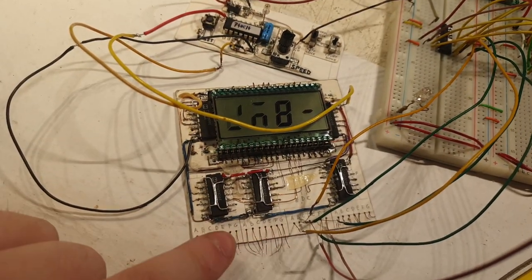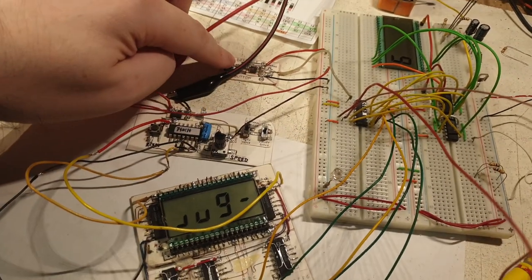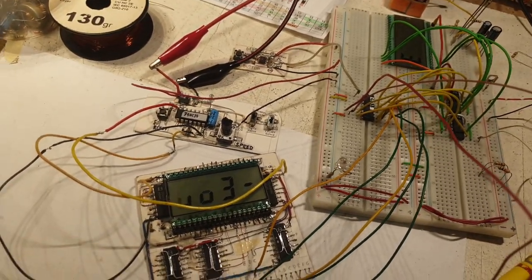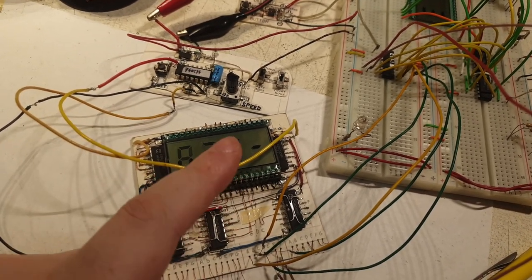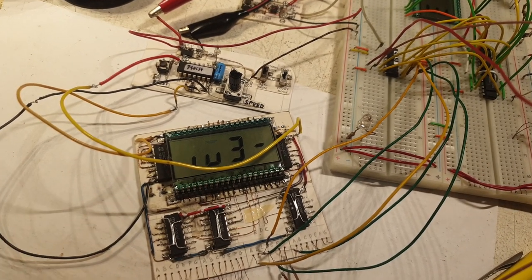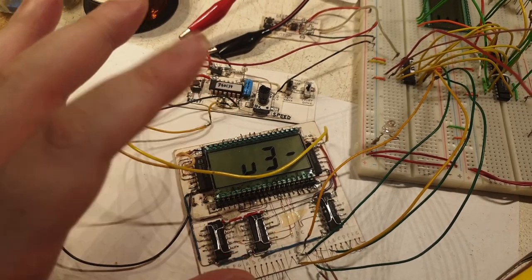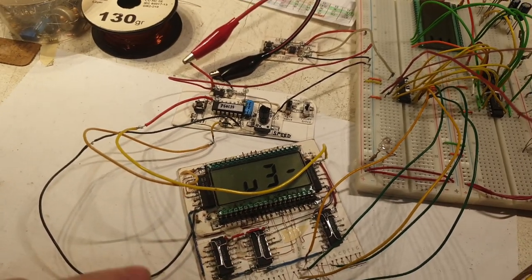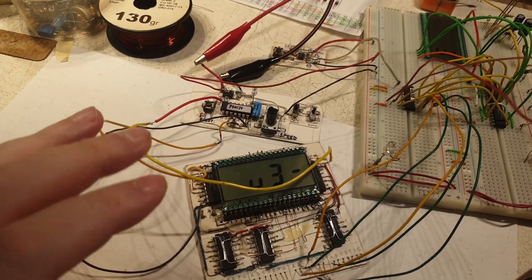Those floating errors are not a real problem. The digit is running in parallel with the reference, commanded by this logic chip: zero, one, two, three, four, five, six, seven, eight, nine, zero. I was extremely afraid that combining gates from multiple chips would interfere and prevent correct display. This was another experiment, a leap of faith — and it's working. It's a big relief that this digit, combined from different chips, still works absolutely perfectly as it should.